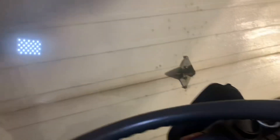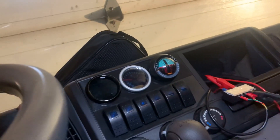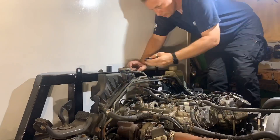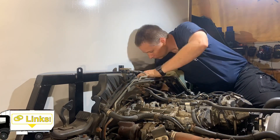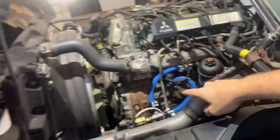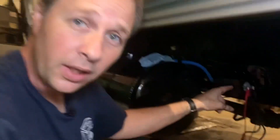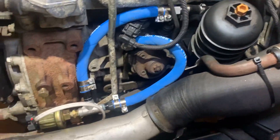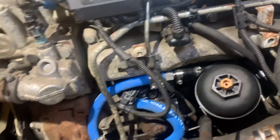While that has been running, I have been connecting up the wiring for the fuel pressure gauge, which is now up in the dash. So when we take the next step and disconnect the loop line and reconnect the engine, we can see if there's sufficient pressure being pushed up by the fuel pump. To disconnect the lines, I'm using the 3D printed tools I used in the previous episode, which I've linked again in the video description. Now that the fuel lines are reconnected, I want to run the pump again manually — not through the truck — and verify there's no leaks on the stuff we did on the engine. Once I've confirmed that, I'll reconnect the wiring on the pump and run normally. Up at the engine, I can hear a little bit of air flowing through the system, which makes sense because there's been nothing in it. I'm taking a look at all the connections up here to make sure I don't have any fuel leaking anywhere, and then we should be good to go.